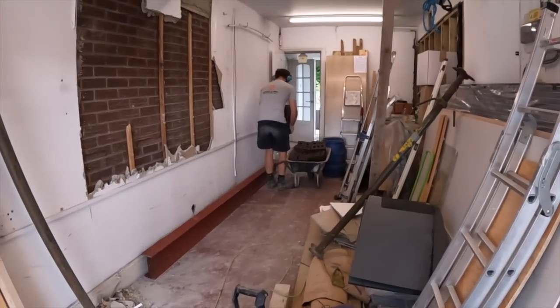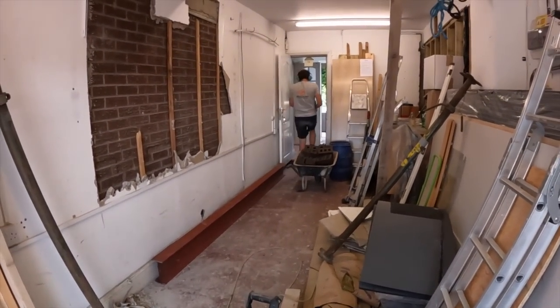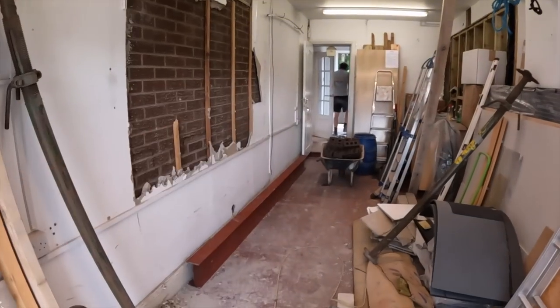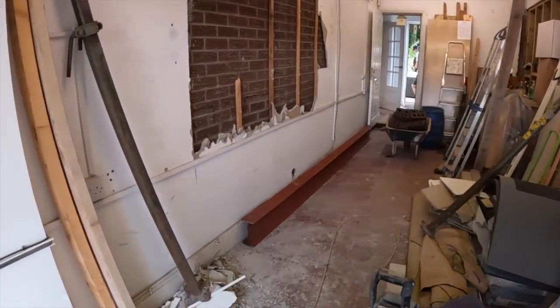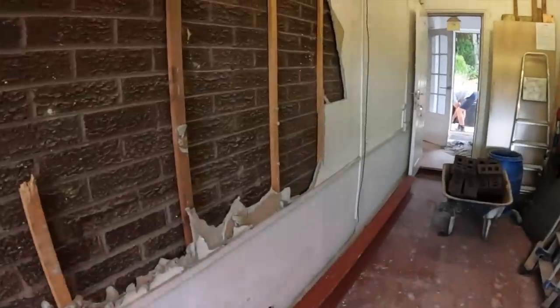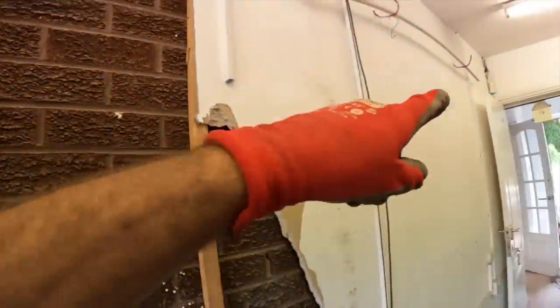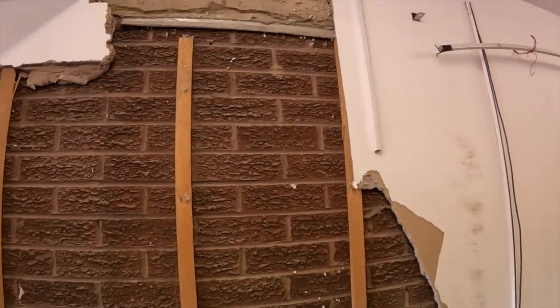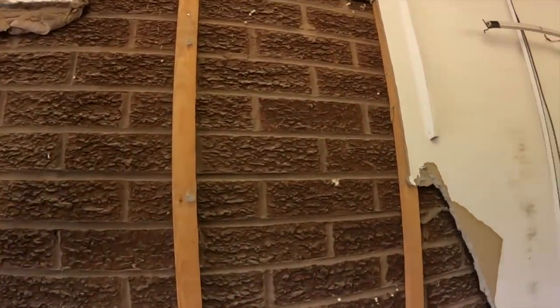Right. Probably after two now. Day one's always slow going. Alex is just getting some of the bricks through to the back door while I'm cutting these steels down. We've got them done at 3/6, but because of the way the pad stones are working, we're coming this side of the steel with our pad stone, and this side of that door with the pad stone, and then whatever opening's left. So I've had to cut the steel down 170, so it fits in there.